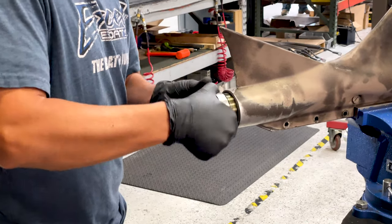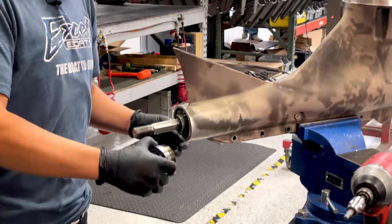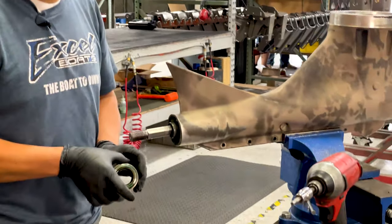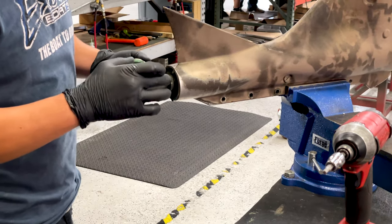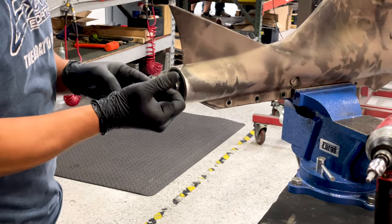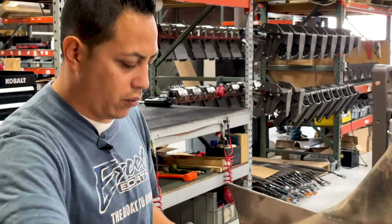This seal cap, just like everything else on the HDRs, minis, and some long tails, is a left-handed thread. Keep that in mind when you're taking it off and putting it back on — you're gonna be fighting it and then realize it's left-handed thread. What we want to check for is that the seals are in good condition and also the wear on this race. This bushing right here — if you see any excessive rust or wear, there is going to be oil or grease coming out, or water going in, which is not good.